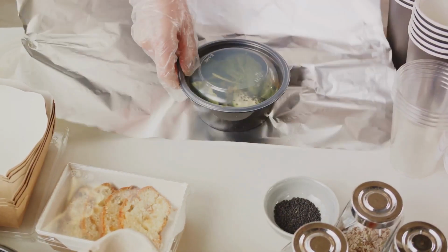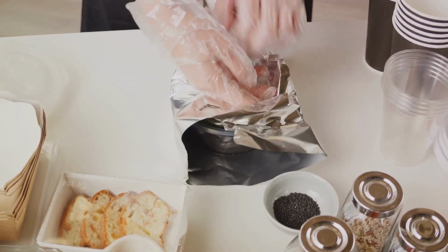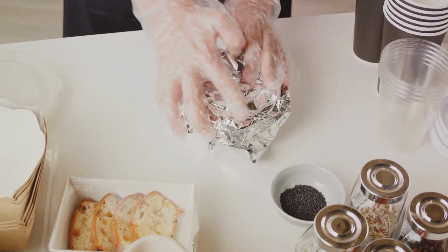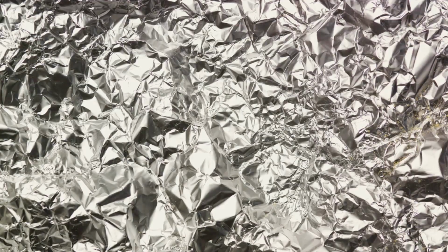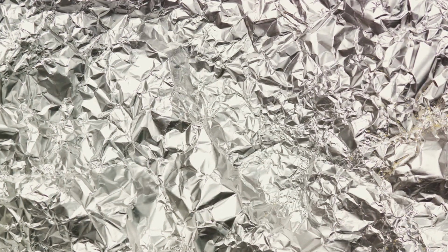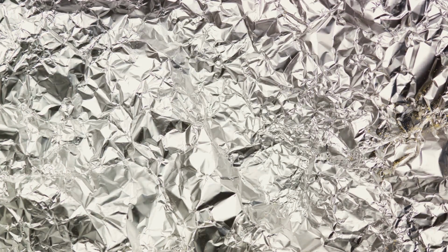The final touch in the process is the finishing. This involves cold rolling the aluminum sheets. Cold rolling is done at or near room temperature, which makes the aluminum not only thinner but also stronger. It's a bit like when you knead bread dough. The more you work it, the better the texture. This entire process is carefully monitored to ensure the foil's thickness is just right. Because after all, nobody wants to deal with flimsy foil that tears too easily, right?